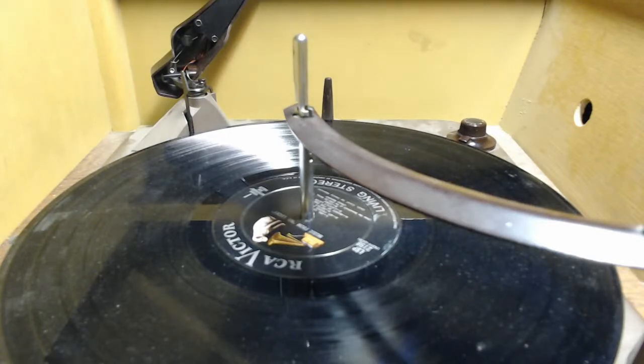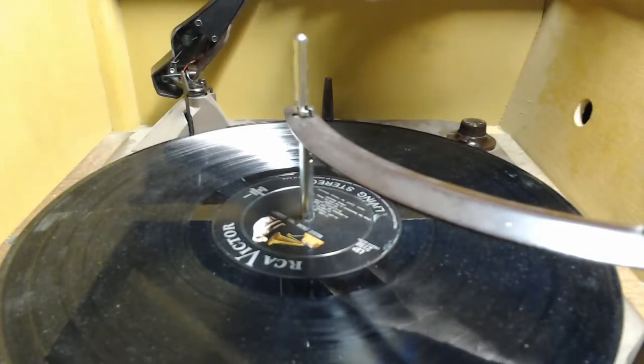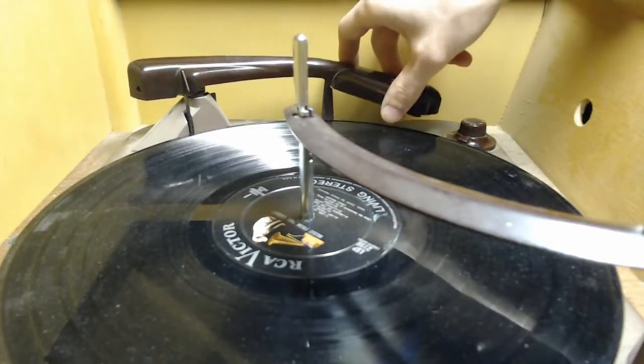The KCCA. This is a generic half-inch screw mount base kit, and it comes with the cartridge and the stylus, which has both 78 and 33 and a third. I think it's like diamond and sapphire, one and the other. And it is a stereo cartridge, but they include additional wiring, terminals and everything, additional hardware, 2 different types of brackets, all that good stuff, so you can get it in there. And this was an easy swap out, get the wires hooked in there. I'm only doing a test connection as I haven't heat shrunk those bare connections there to finish cleaning all that up. But we're going to go ahead and put this on my demo RCA record here.